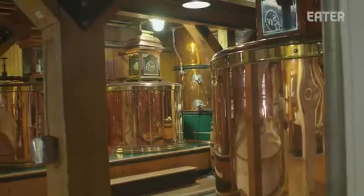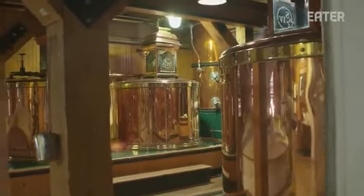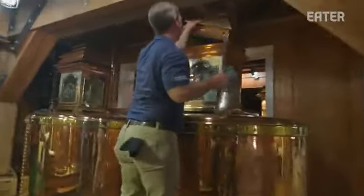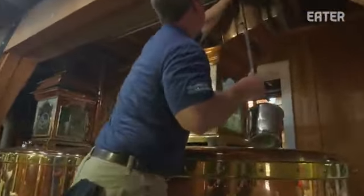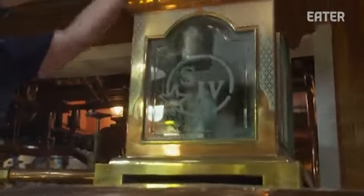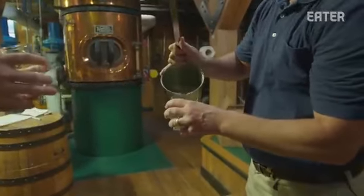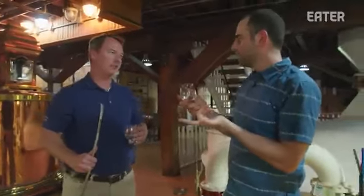Next, the fermenters are drained and sent to one of the distillery's copper stills, which use a series of plates and steam at about 216 degrees to carry the alcohol up as vapor and drop all of the solids down below. From here, the alcohol vapor is cooled back down into a liquid state, forming what is called White Dog, or a high-proof distillate ready to be aged in a barrel. So this is Maker's Mark. Yeah, this is Maker's high proof distillate. Yep, 130 proof, 65%.